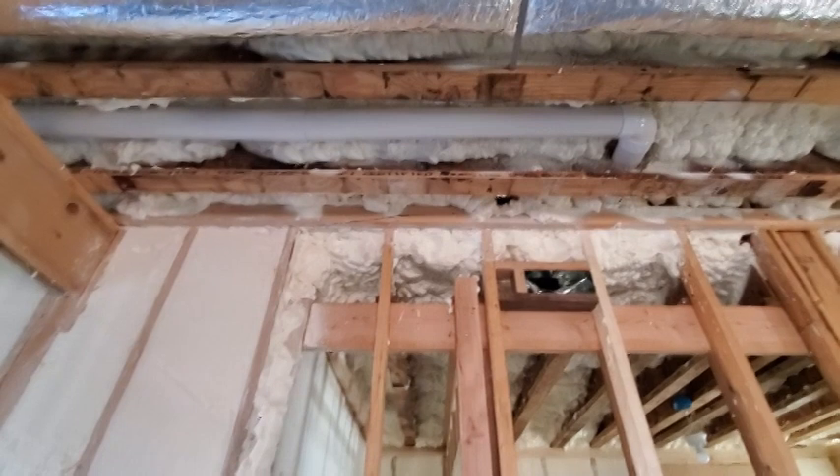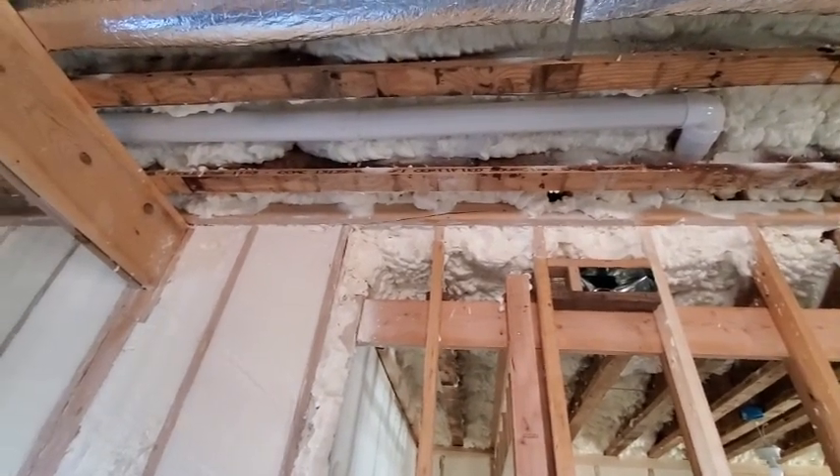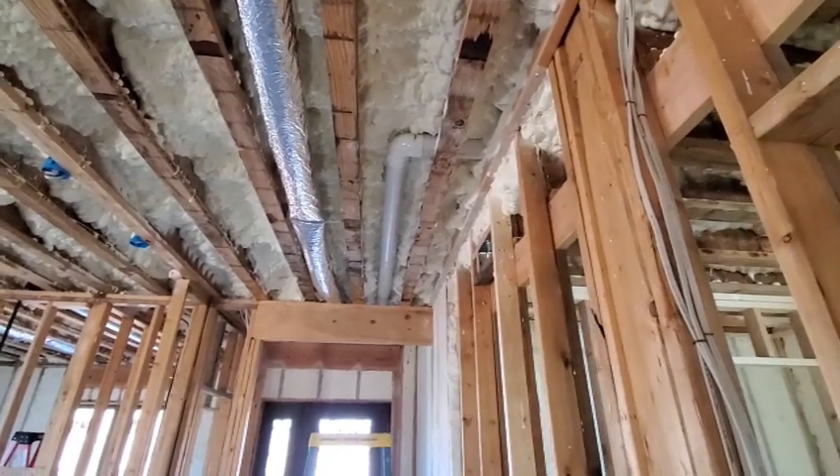That worked out pretty good - popped in all the way. I'll go ahead and tape my seams and be done with it. I use KY for a couple of reasons: it's water soluble so clean up is easy, unlike some other stuff. You can use it on plumbing fittings quite a lot because mostly plumbing fittings have water running through them. Especially getting onto a brass fitting - just put some KY on there and slip it right on pretty easily. Because water flows through it, it'll dissolve anything in there. Other lubricants could stay in there or may have harmful chemicals, so this stuff is clean and safe. Got that pipe fully run now up to the ERV.